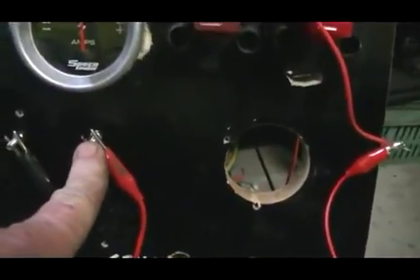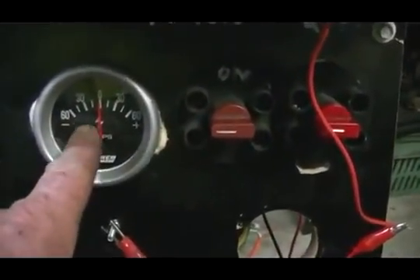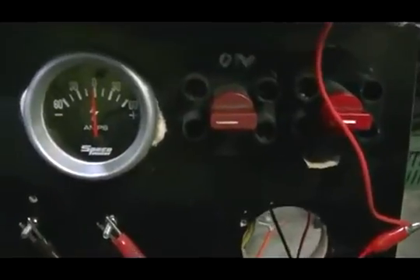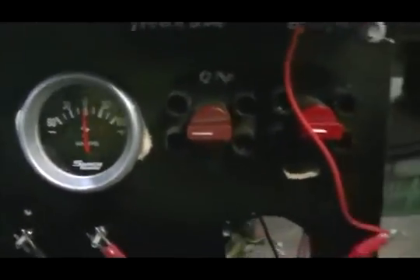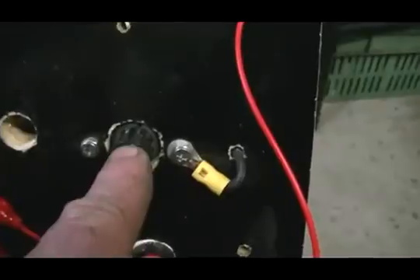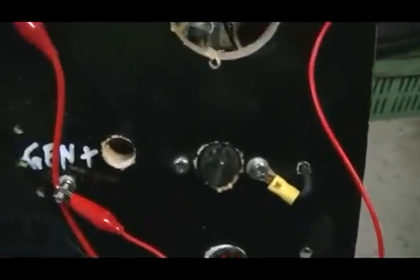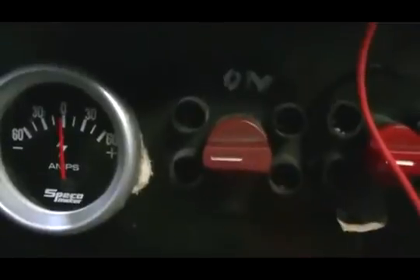This is from the positive terminal of our 24 volt battery bank. We then go through this digital meter down to the motor. I've disconnected the big amp gauge for the time being because it shows very little in the way of current draw — it's hard to tell exactly what it's drawing. This is our generator output, and this pot here is the big resistance pot for the exciter windings on the generator. This is our on/off button for our motor and this is our on/off for our generator.